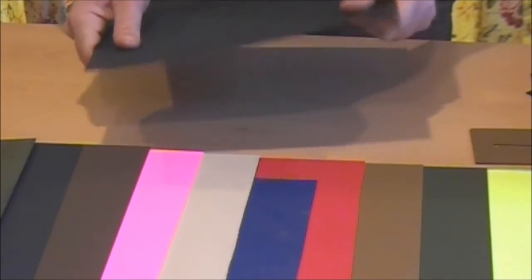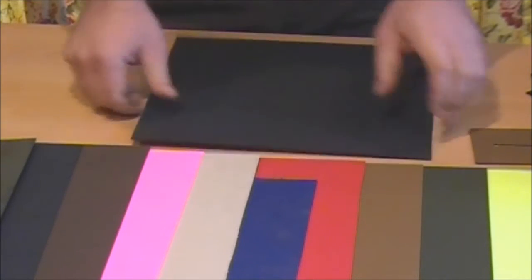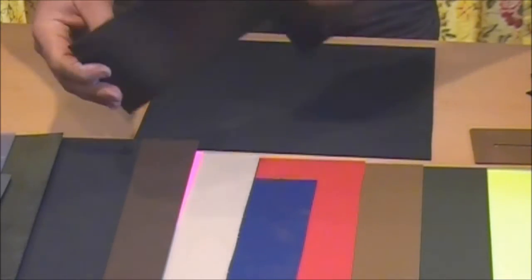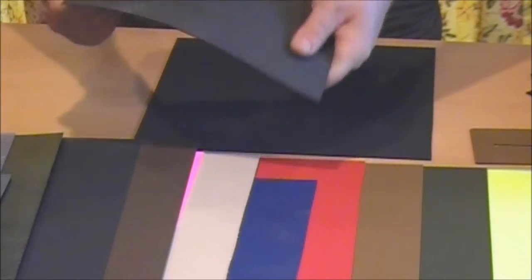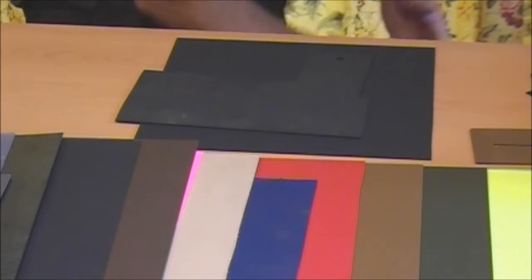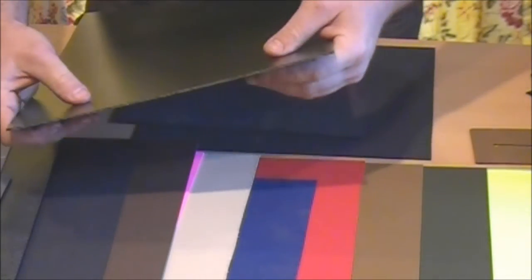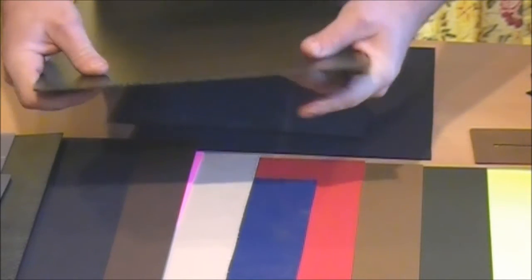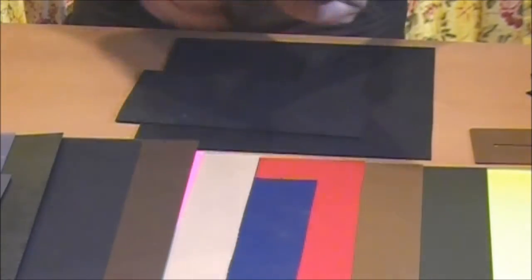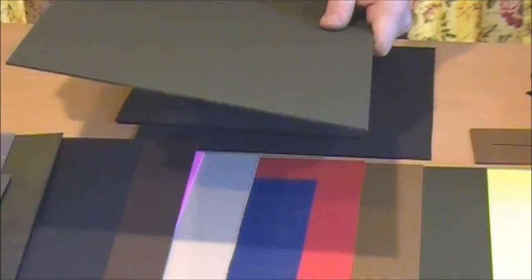as I say, this is 12 inches of 80 thou, 2mm sheet. This is the general thickness that most sheaths will be made of. It's reasonably flexible. Okay, we have here somewhere, this is a piece of 60 thou, 1.5mm, a lot more flexible, and this is a piece of 93 thou, again a bit more rigid. So we need to look at the stiffness that we want for our sheath and match that to the material and the design that we're doing.